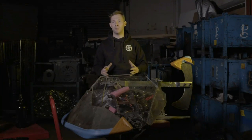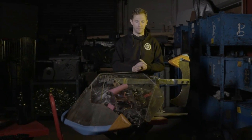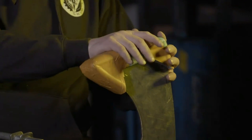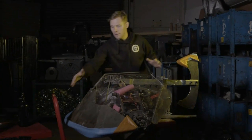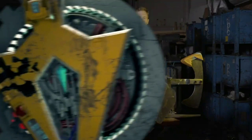Pit safety at Robot Wars is very important. Once robots come out of battle, they tend to be scarred and damaged, so once they're back on the pit table they must be safe to handle. Number one is sharp edge protection — simple covers that slide over sharp elements such as weaponry or the front scoop. Another necessary item is a robot cradle. This needs to be a simple device, made from wood or steel, that raises the robot up off the table surface. This stops the robot from moving or rolling off, and also means you can test your drive systems without the wheels touching the surface.